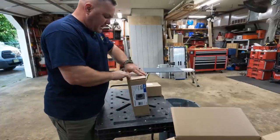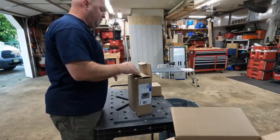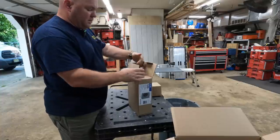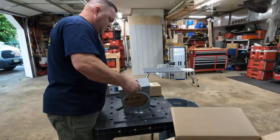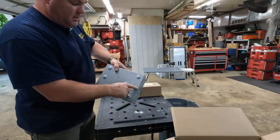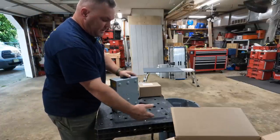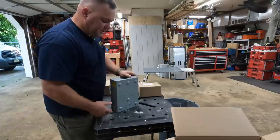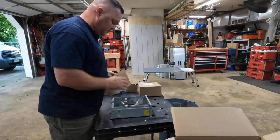And this particular panel, I know that the meter pan is going to sit here, and directly behind is going to be the panel. So what I'm going to do is take out the bottom rear knockout, which should be 1¼-inch, which is here, so that there'll be a nipple, I'll figure out the size of the nipple when I'm there, into the back of the panel, and that's how we'll achieve powering up that panel from the service here.